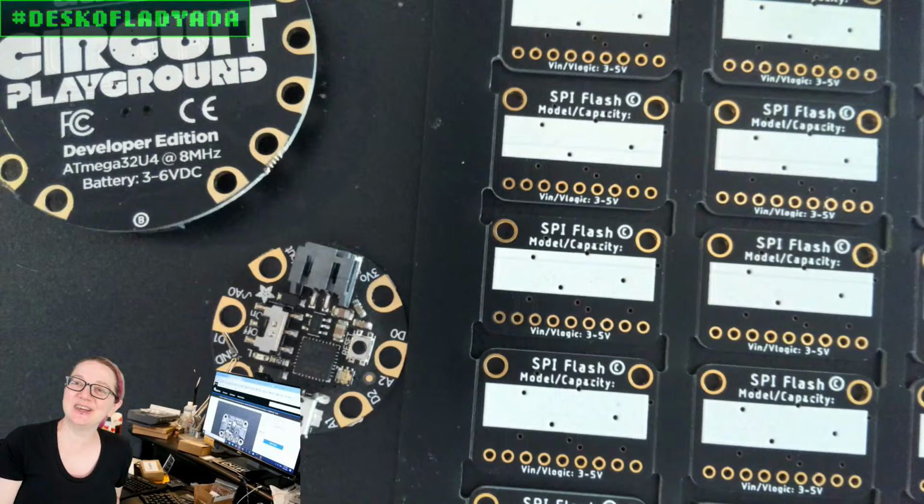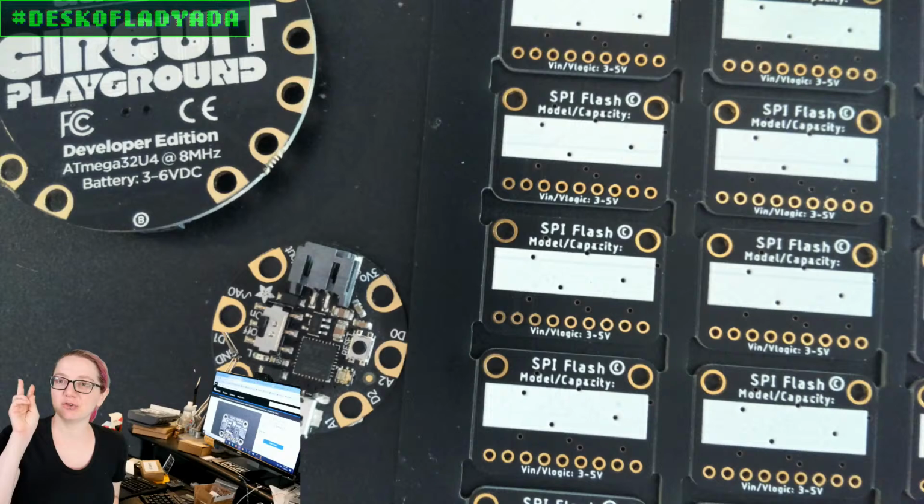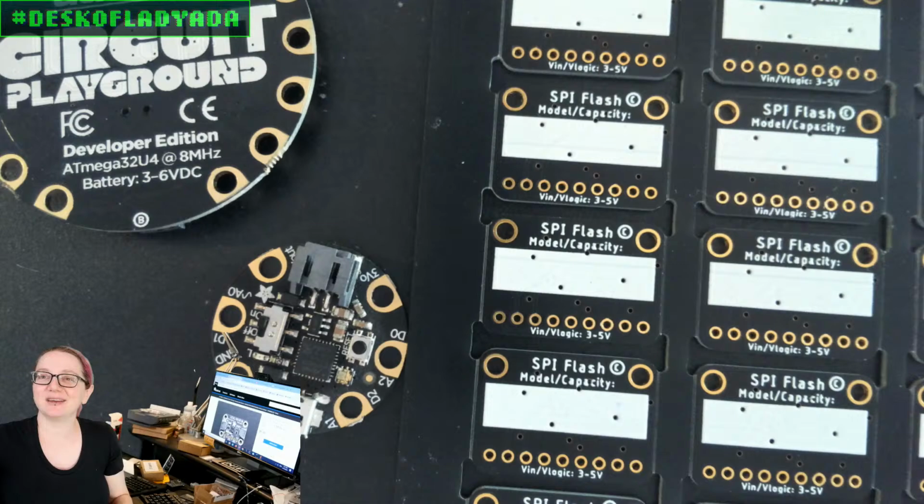Anyone who's actually tried to use it knows that if you use the proportional font, when you render out the Gerber file from EagleCAD, it gets converted into a vector font. The proportional font is not actually rastered out. It's also kind of a Helvetica knockoff, and we were like, what if we wanted to use different fonts? So a week or two ago, I sent PaintYourDragon off, and I said, go figure this out. You're smart.